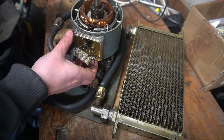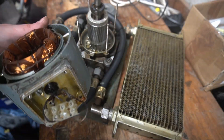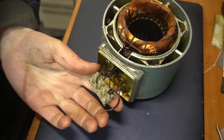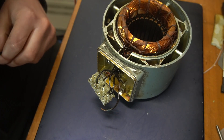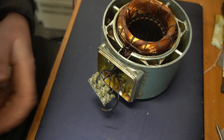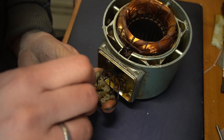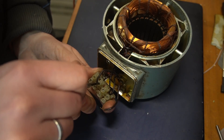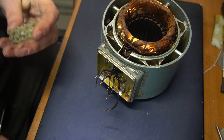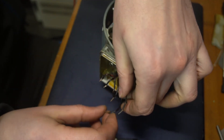You see me disassemble my motor to clean it, which is probably confusing — you don't have to do this to fix it. So here we have six wires hanging out of the stator case. I have already tested that the spool's resistance is the same for all three of them, none is shorted out, and also that there is no short to ground. It is easy to find the wires that belong to each spool by measuring the resistance between cables, but how do we make sure the polarity is right and no spool is working in the wrong direction?